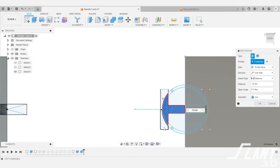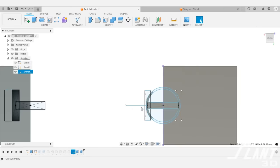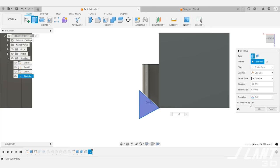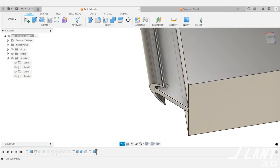Even though the T-slot is functionally okay, you still have tolerance issues keeping the seam pulled together, and material shrinkage means it won't always work well. But there's an upgrade to the T-slot: you can curve the slot just a bit so that the two outer flanges, instead of pressing into a hole with a friction fit, act like springs. Now you have a part that locks into the slot with no jiggle and no tolerance issues, giving you flexible tolerances that handle material shrinkage. We also angled this slot so you get a very simple square first layer with rounded filleted outer edges.